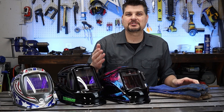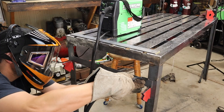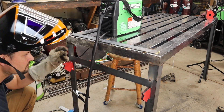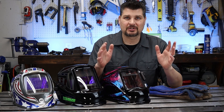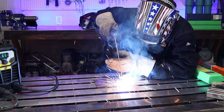When I started out I just used some leather work gloves and they worked great, but most people don't know that welding gloves have a couple of purposes. First of all, if you're flux core or stick welding, it throws out a lot of spatter, so the extra long sleeves help out with that. Also, welding throws out UV rays, so if I'm just doing a small tack job here and there I'll have at it, but otherwise I do like having a welding jacket or at a minimum long sleeves.